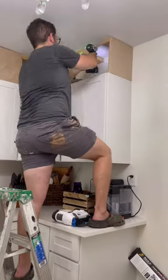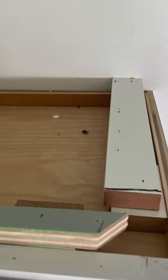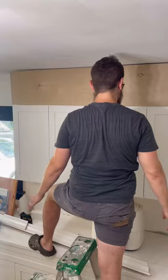To those studs, we're going to be attaching two-by-fours — this is what our cabinet fronts are going to be sitting on top of. Move the trim that was supporting the molding back three-quarters of an inch. For the cabinet extender fronts, we're going to be using three-quarters of an inch cabinet grade plywood, cut down to the width of your gap.